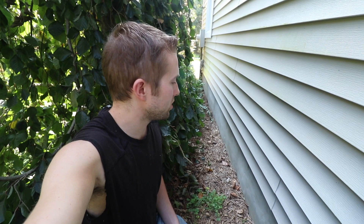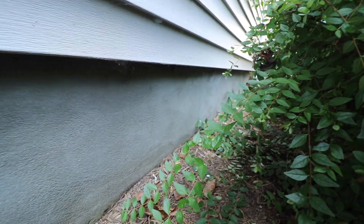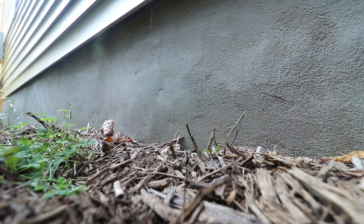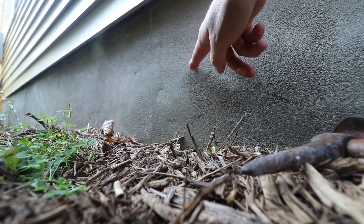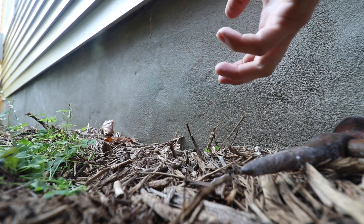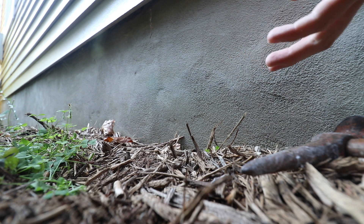So before I made that video, this is the first 40-foot piece of foundation that I did, kind of to get my practice in to make it look good on camera. Here's what that first 40-foot section of foundation looks like after one year — and everything looks really good. People question whether there are any stress cracks, and in this piece right here I see absolutely no stress cracks. The reason is because this is such a sandy mix — two parts sand to one part Portland — and because there's so much sand, it really allows things to expand and contract a little bit, therefore preventing cracks.